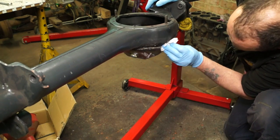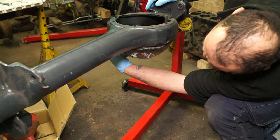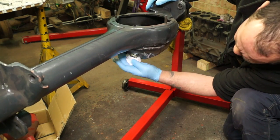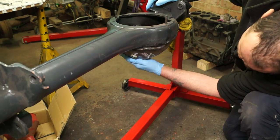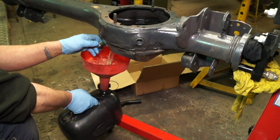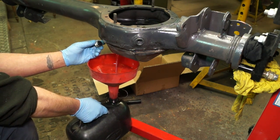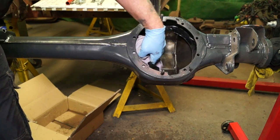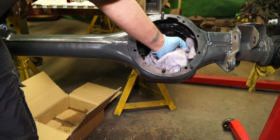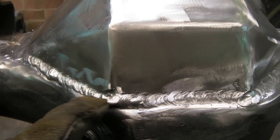This is the cheap way of doing it. Just check it with a piece of dry paper. Any leaks whatsoever, you've got to find where they are and then rectify them. Diesel removed via the bung plug — I'll remove the other bung plug and it took all the diesel out. It is worth removing every last drop of diesel and then wiping it out. This also acts as a cleaning agent.